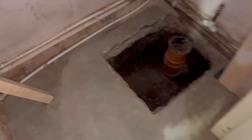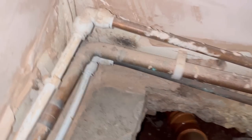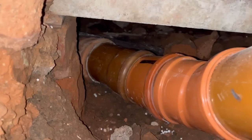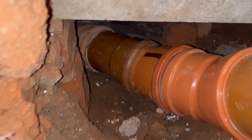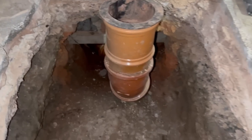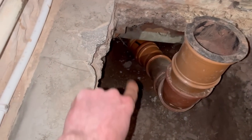And while Charlie's doing that, I have done this. So if I get right down here so you can see, the connection. It's under there, look. There it is. It was right there under the lintel. So I've used a series of slow bends there now, 15s and 30s, to get me to this point in the centre. Nice slow bend all the way down.